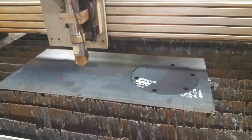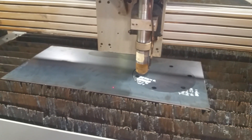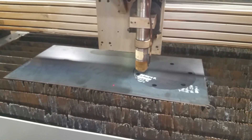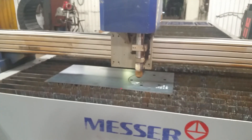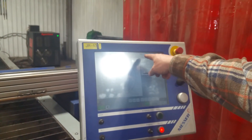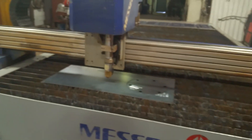So you would nest whole plates apart, right? Oh yeah, you could nest a big table ahead. I have a pretty good sight. So that's done. I'm going to go ahead and hit stop and return to start. Now it should go back to there. I'm going to go into full fire mode. It automatically changed my inches per minute back down to what it should be instead of full power. Here we go — this should fire.